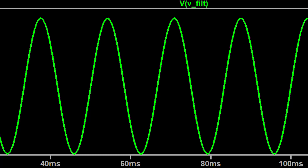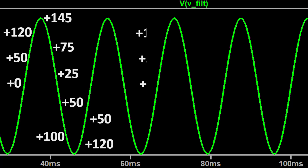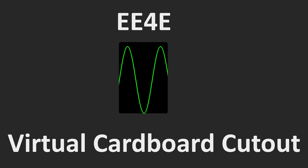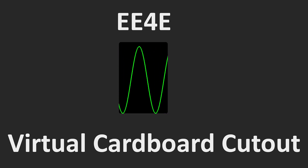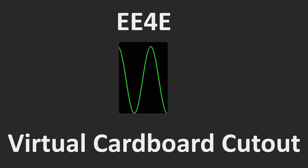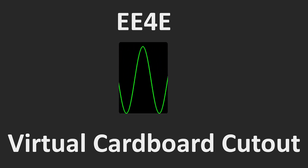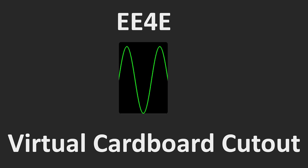Here's what the new control loop is doing. It continuously adds the latest measured output voltage into a buffer for n half cycles — in this case n is three, so three half cycles, because that's the shortest period where a 60 Hz sine wave comes out to a whole integer number of milliseconds, which is our control loop refresh period. So we measure and record the output voltage, and after 25 milliseconds or three half cycles, the microcontroller computes the average output voltage, runs the control loop algorithm, and adjusts the output scaling factor as necessary.